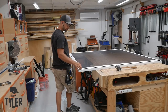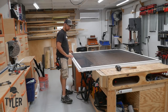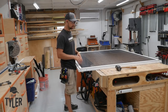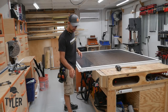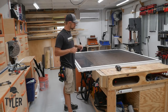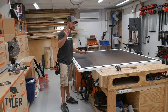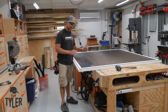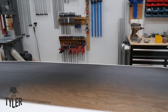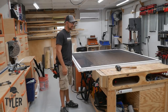There you are — screen is done and looking like a trampoline! We're going to go ahead and install this. This install is going to be much different from someone using an aluminum frame, but I'll take you along. If you had an aluminum prefab frame it's probably going to click into your windows with some little tabs. The concepts of installing the screen are exactly the same — that's a tried-and-true method to getting trampoline-like screens. There's not a single wrinkle in this screen and it is looking fabulous. Remember your orientation when installing a big screen like this, and let's get it outside.